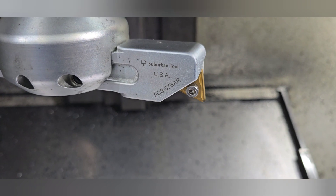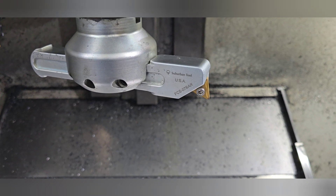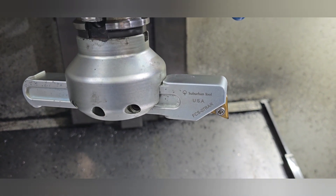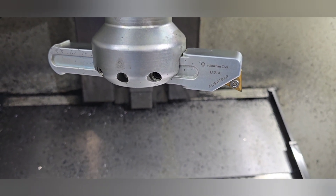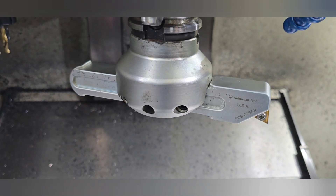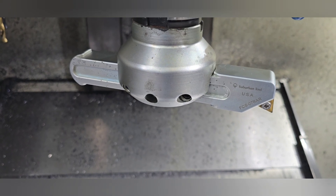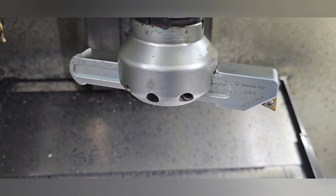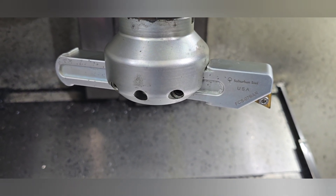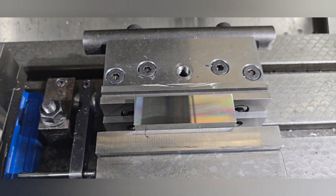We recommend that you never use this tool with coolant or cutting oil — ever, on any material. Even on aluminum and steel it can take up to 25 thousandths in mild steel, and in aluminum you can take up to an eighth of an inch and you're still going directly to finish.